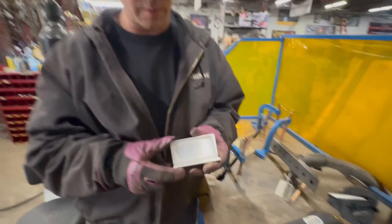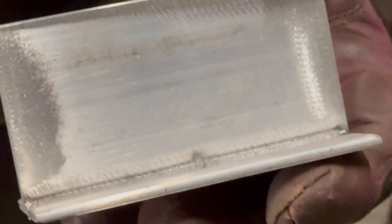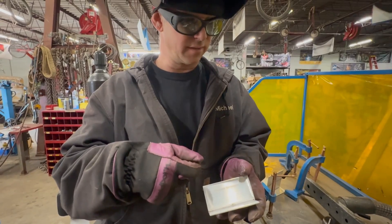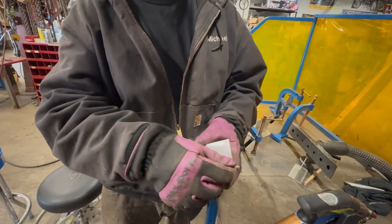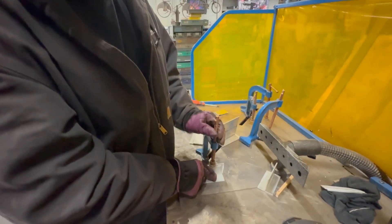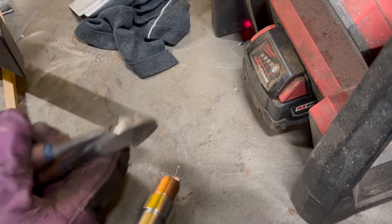This is our first demo T-joint weld. You can see there's a spot in the middle where something happened — the gun got stuck for a second and I had to restart — but that's still a very good laser weld. Next we'll turn it around and do the other side. Since you're putting pressure and dragging the gun, you need something holding your workpiece down so you don't push it out of the way. You can see the red dot right here — I'll trim my wire right at that red dot and we'll be ready to weld again.